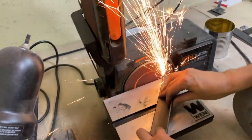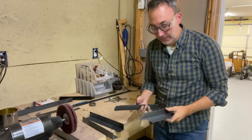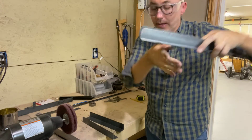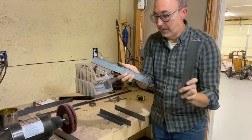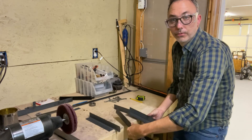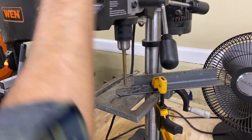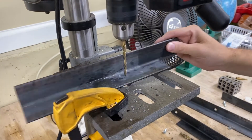I cut out a relief to allow for the mount to rotate and then rounded over the edges on my disk sander. I've got some of the parts cut out. This is the part that will let it rotate — it will hang over the box and be mounted like that. I've got these parts that are part of the bracket; these will have a hole in them and do the rotating. I drill the mounting and rotational holes on my drill press. I'm using Tap Magic as coolant here — it's a little too gummy and I don't actually like using it, but it's all I had on hand.